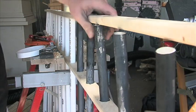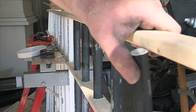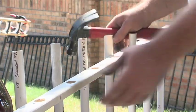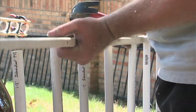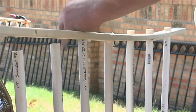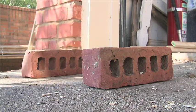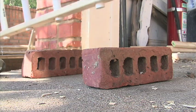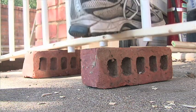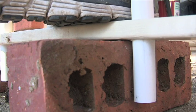I'm using a steel hammer, but you'll probably want to use a rubber mallet. Steel can actually crack and break your wood and takes a much lighter touch. Once you've got all the PVC in place, you're ready for the top rail — it's going to have a tighter fit on the PVC than the middle rail, so you're going to need to tap it into place. Simply start at one end and work your way down to the other. The bottom rail is done the exact same way. You'll notice this one cracked — should have used a rubber mallet — but I'm going to show you how to fix that. After you get the bottom rail on, you're going to want to adjust the spikes below the rail to the same length. I do this with bricks: put two on the ground, put your fence on top, and tap the PVC down to the ground using the brick as a guide. You could do this with the top as well and have spikes on top of your fence, but for this one, I'm not doing that.